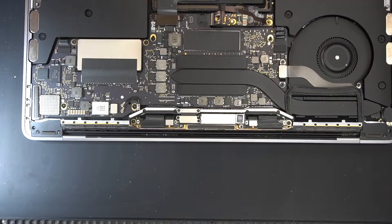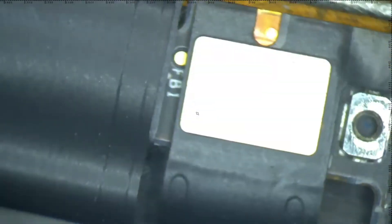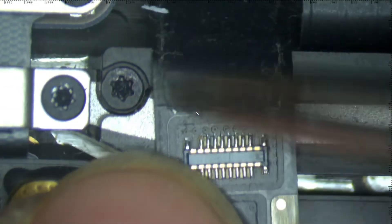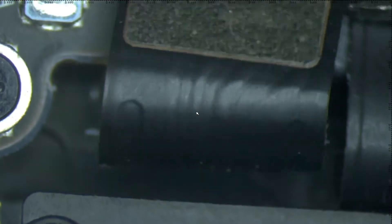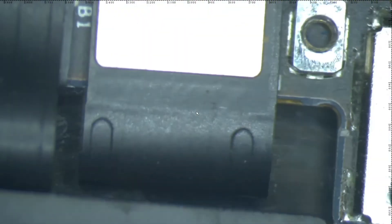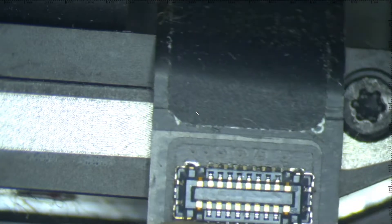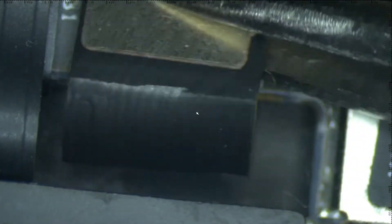So let's see which flex cable is damaged and replace it. As you can see, the second one is the damaged one. There is a crack or a break in the rails in the flex cable which prevents the data and the power from flowing to the backlight.